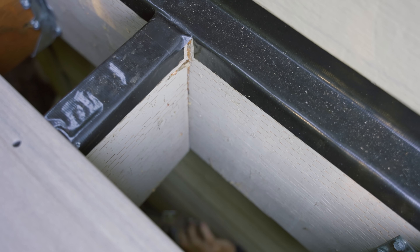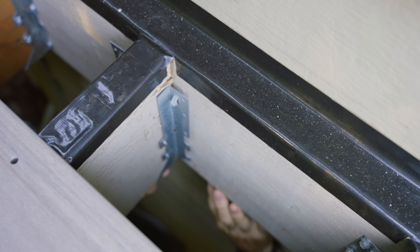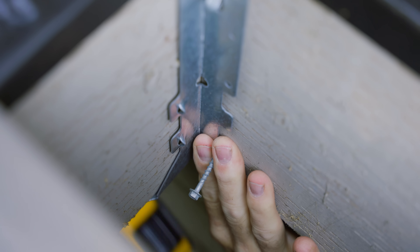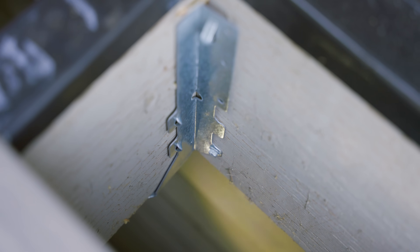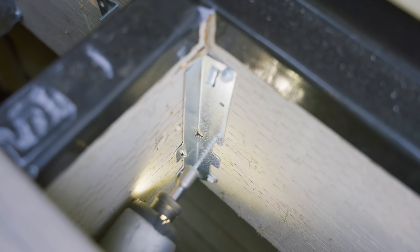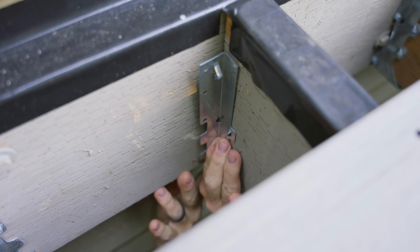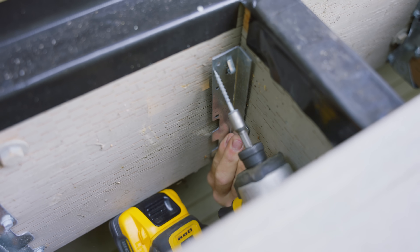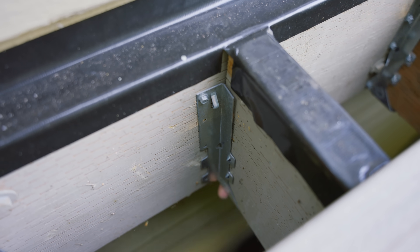You can't really see me because I'm underneath the deck, but the most important thing is that you see how this is installed. I'm going to push up on this hanger and make sure that the bottom of it's touching the bottom of the joist. I'll go ahead and put one screw in this side to start — this is a quarter-inch drive bit on my impact driver. Once that one's in and I'm happy with it, I need to do one of the higher ones. Those four are in, and the hanger is sitting nice and tight up against the bottom of the joist. This is really a little bit of a compromised situation, but that went in really well.